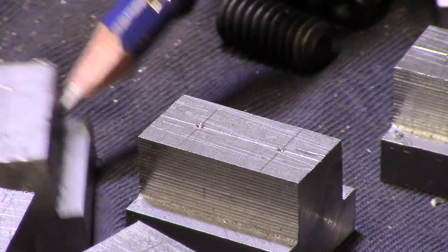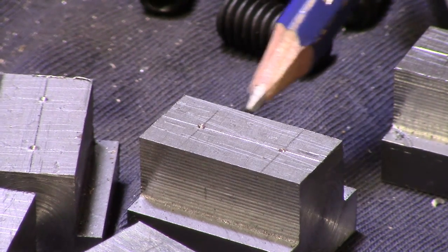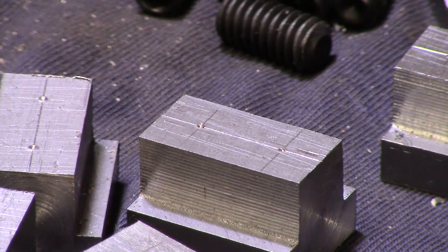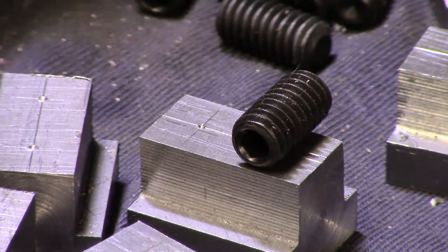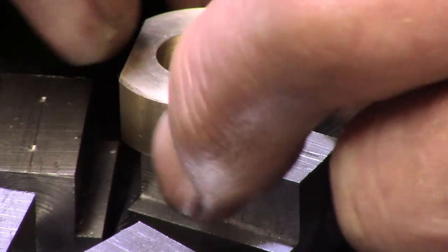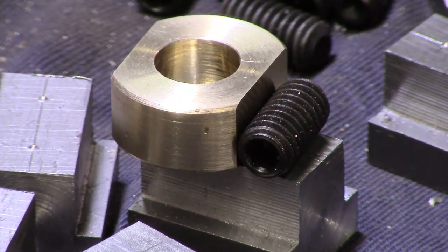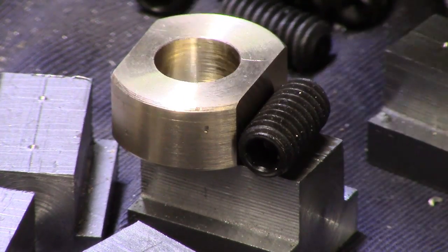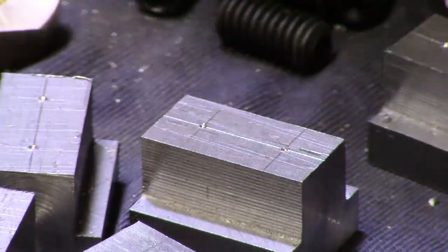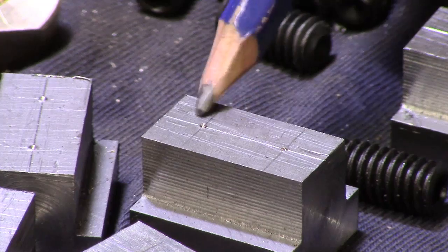So what I'm doing here, I'm really running very tight on available space, because I can't make the T-nut significantly longer. And the other annoying thing actually is I'm going to have to use a different thread for the locking set screw compared with the metric for the button. I'm trying to see the center hole there. These are going to be absolutely side by side, very tight, but there's enough meat underneath the button just, and once the grub screw is locked up, we should be able to concentrate then on setting up the button.